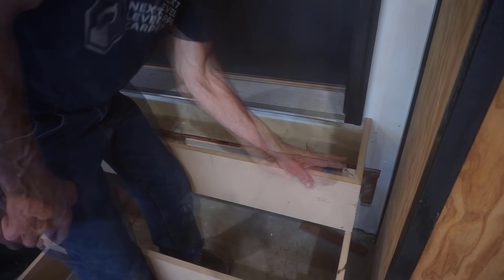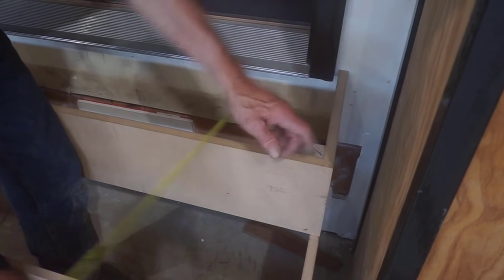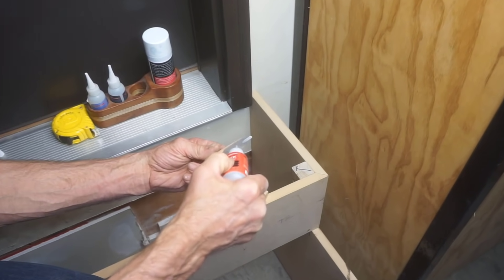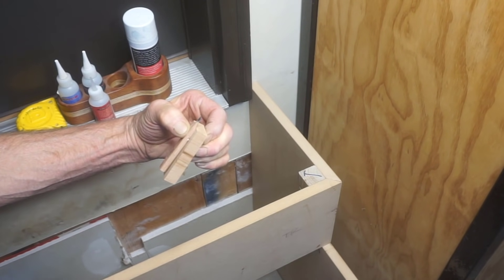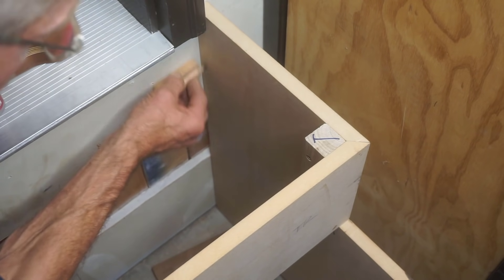The half-inch margin line I had on the pattern reassures me that I'm on the right path. At the wall, I left an extra half inch of material on the back of the stair box — and as it turns out, that wall is leaning about an eighth of an inch, probably just in the sheetrock. I need 11 inches to the face of the riser, and this shows 11 and a half, so I've got to scribe a half inch off the back of the stair box. To mark it in the cramped space, I glue the stubby projected point pencil to a scribe block cut to exactly a half inch using CA glue, giving me a clean pencil mark to cut to.